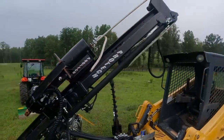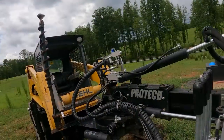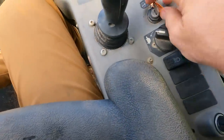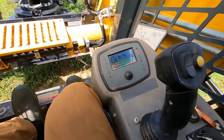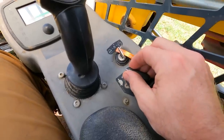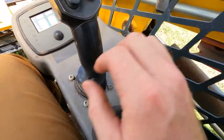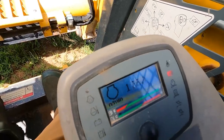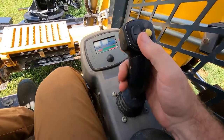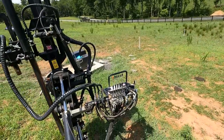This is the ProTec P240 post driver — a hydraulically driven post driver. I'm sitting in the operator station in the RT210. We'll turn the key on, wait till the beep goes off, all the lights go off, and start it up. We'll bring our RPMs up to about 1800. We'll engage our hydraulic system right here. Now we've got our hydraulics engaged. We'll hop out of this machine and get everything lined up for the post driver. We've got two feet on the post driver that have to come down in the back and one foot that comes down in the front.